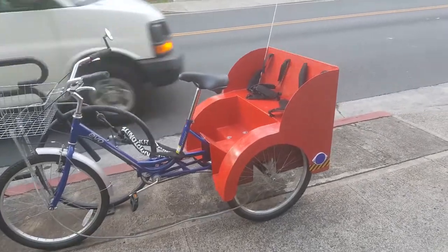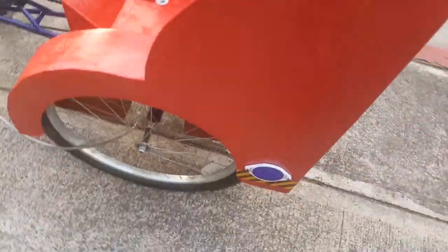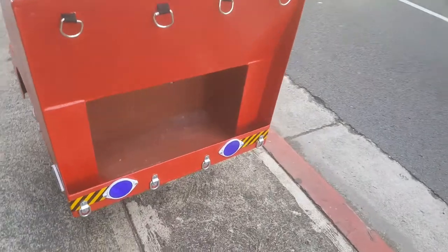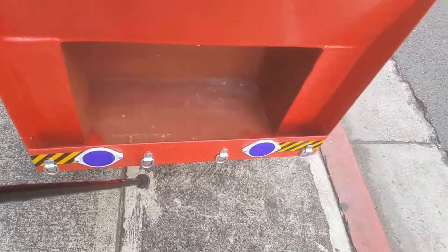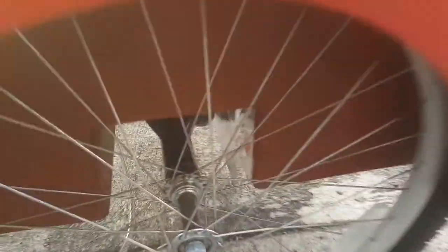Here it is — it's done! I got the seat belt on there, I got the safety flag, and a couple of safety features including some hooks to tie stuff with. I did have one major problem: because I made the drop five inches it barely misses that frame part, which causes too much weight on the backside. So I had to modify it — I added a little board to keep the weight off.